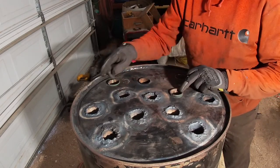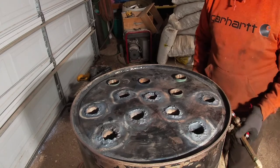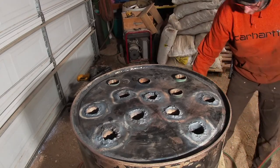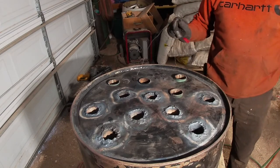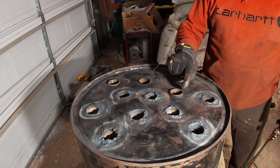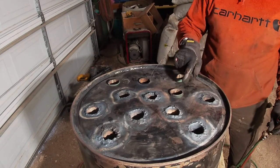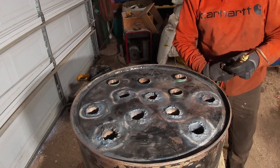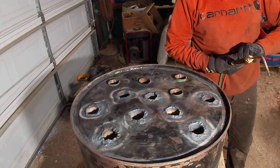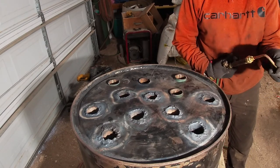It's real hard when you're welding real thick stuff to thin stuff. I'll go ahead and fire up for the last couple here. I did learn that if I can melt the pipe down and run it down and weld it, it works best. But sometimes I get the angle of the torch wrong or something and it doesn't work. Wound up blowing a hole in it.